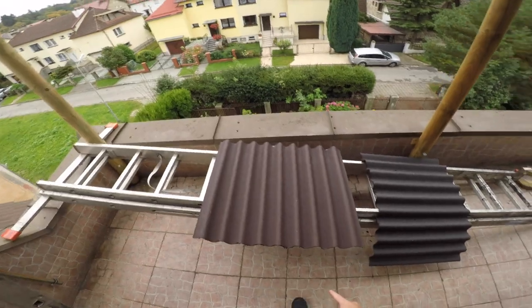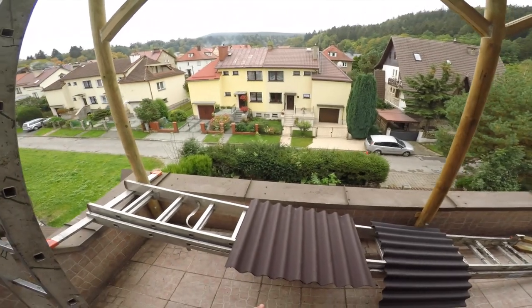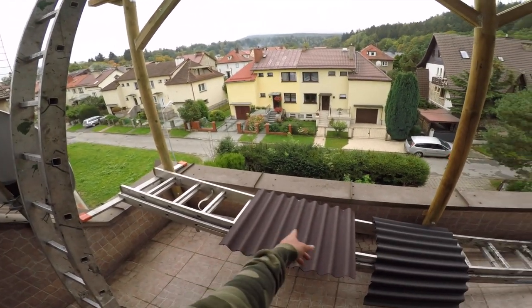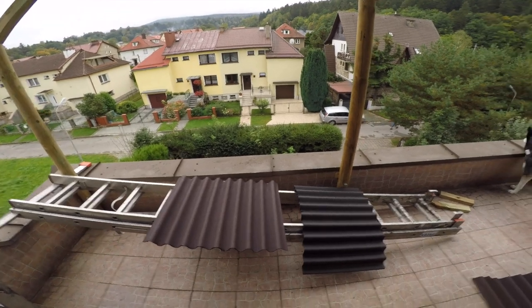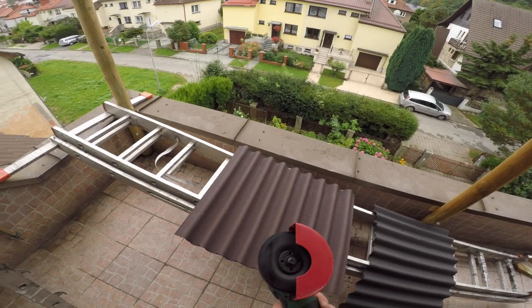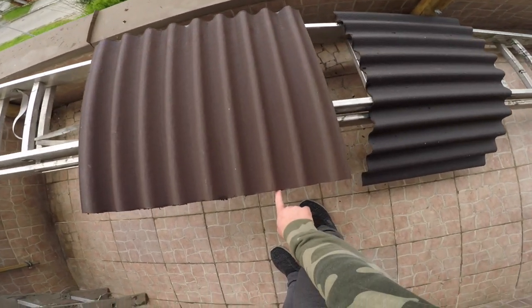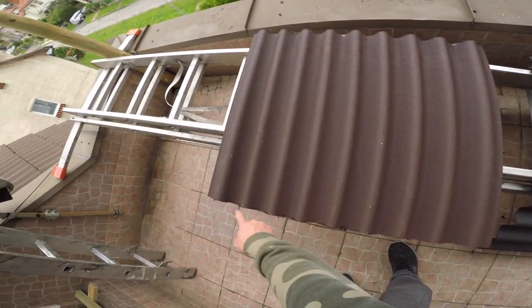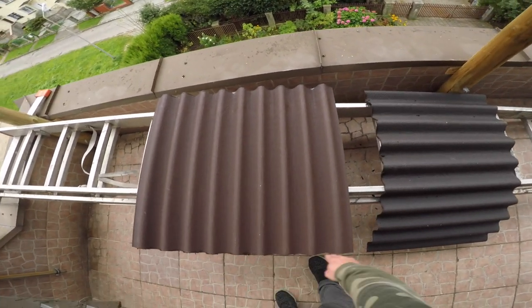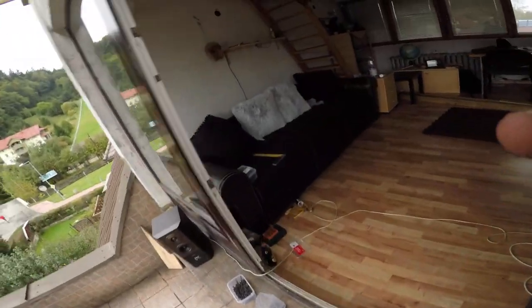If you do stuff like this, the best way to cut it, I tried the cutter, I tried the metal sheet scissors, nah, angle grinder, man. It just eats it, and you can go so precise. See, this is with cutters and stuff, all of this with angle grinder. You could cut one on this side, turn it over on the other side. Amazing. Thank you, Grandma, for the tip. See, you learn shit from everybody.